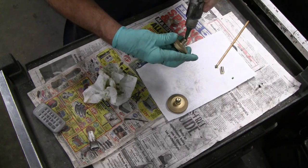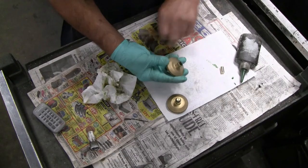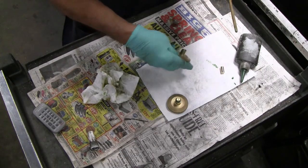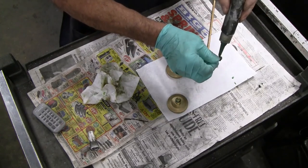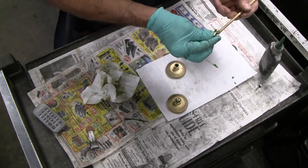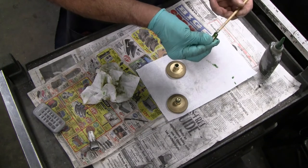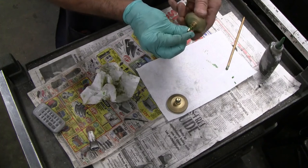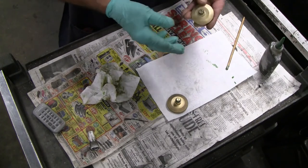Repeat on the other one. Bit of adhesive in the hole. Spread with a wooden dowel. Grab the end. Spread again over most of that contact surface with a wooden dowel. And screw it in to be sure of a uniform distribution of adhesive